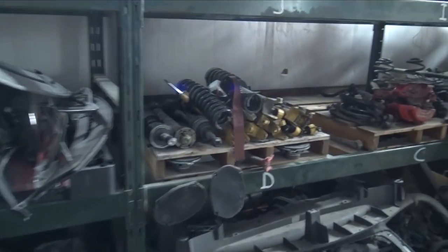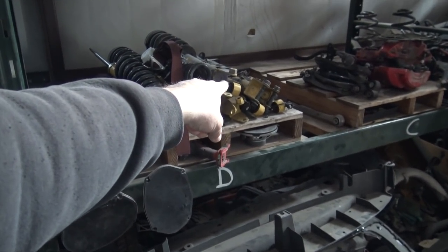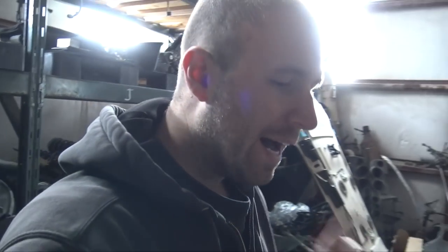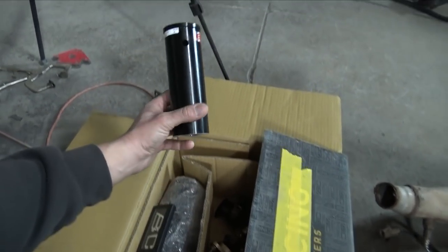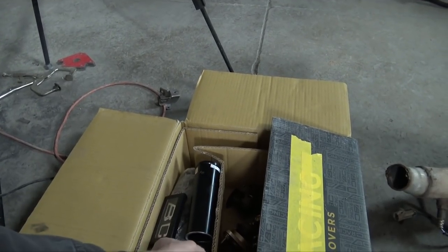Also, on the rear suspension, I was gonna make something similar to the, you can see where they're at, the Trackhawk rear struts right there. They have like a fork. But since I'm running true coilovers and the whole suspension setup's different, it's in a Charger, I was gonna modify these to make them work with a fork. So I cut the bottom off on the lathe.